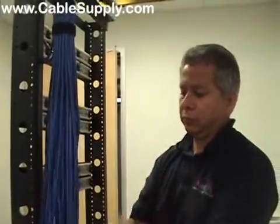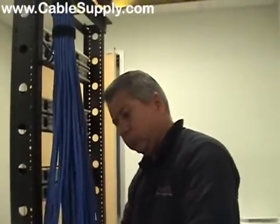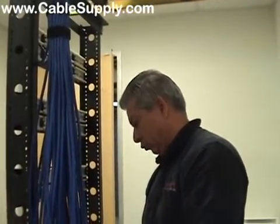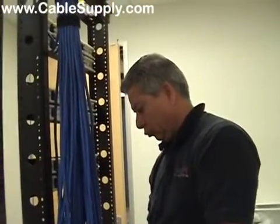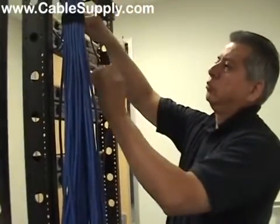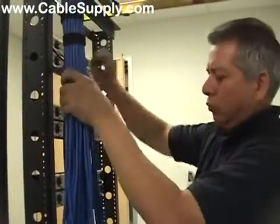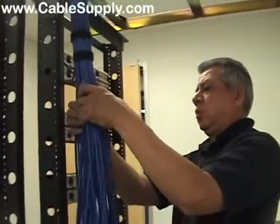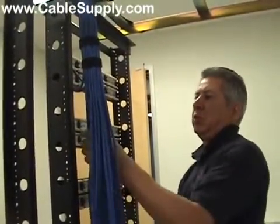But in reality, if you just cabled it as the cables flow and then identify where it's at on the patch panel on each jack, it's half the labor involved, because you're not tracing one cable at a time. That's kind of time consuming, to mark the cables and then trace them as you dress them in. But at the same time, it's just as easy. You go up to the jack, you look at the number on the jack, and then you go to the patch panel and you know exactly where it's at. Or you number them on the floor plan, so people know in this room there's a jack that is associated with port 22 on patch panel A. So it's pretty straightforward like that.